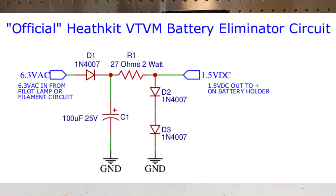The diodes are not critical and can be any 1N4000 series or similar silicon rectifier diodes. The capacitor value is also not critical and a higher value could be used. The resistor will typically only be dissipating about a quarter watt, so one with a smaller power rating could be used, but it's good to have some safety factor, especially as there's little convection cooling in a closed metal case with two tubes operating in it. This circuit should work with any VTVM that has a 6.3 volt AC filament voltage available that has one side grounded and where the negative battery connection is grounded. Take care not to reverse the wiring and short the filament voltage to ground as it could destroy the power transformer.